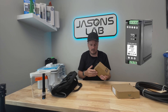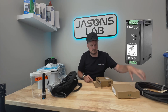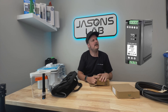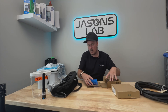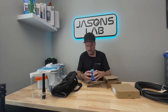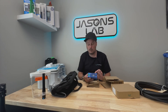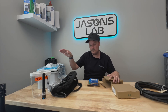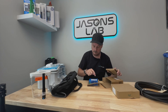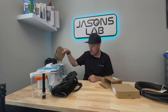In here is the power supply. What it allows us to do is run 110 volts to this and then connect it over distance. I think you can go up to a thousand feet or more of cable for fiber at 1 gig, so at home you're pretty fine. Tom sent me a 60-watt power supply at 48 volts — actually it's 44 to 57 volts because you'll have voltage drop across the cable over distance, so at the far end you still have the minimum voltage spec for the switch.